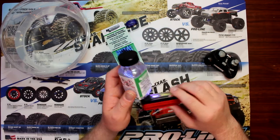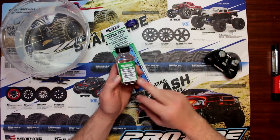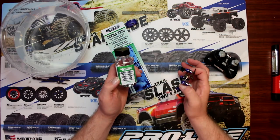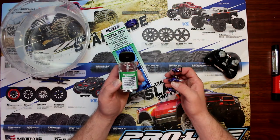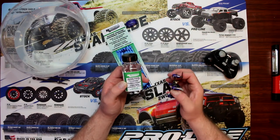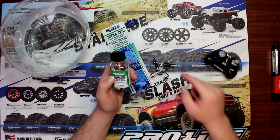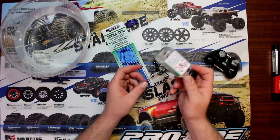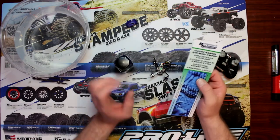This is one of the things I love about the silicone modified conformal coating — when you apply it to the quad, or whatever you want to apply it to, you could apply it to a receiver, a servo, basically anything electronic. You can see where you applied it. Also make sure when you're going to use this to be in a well-ventilated place.